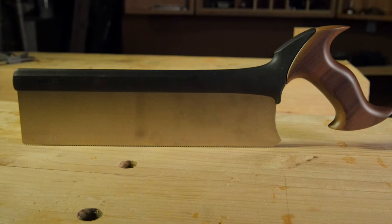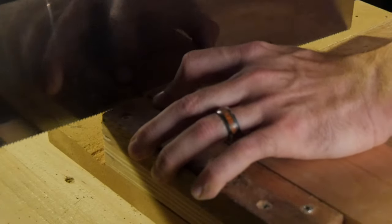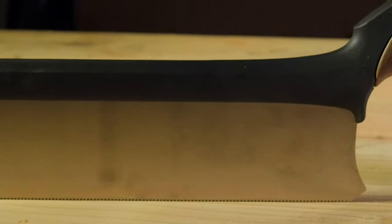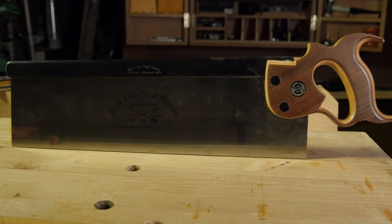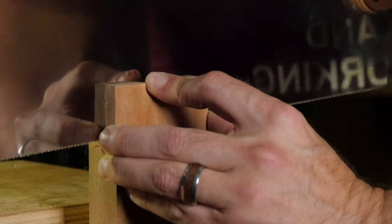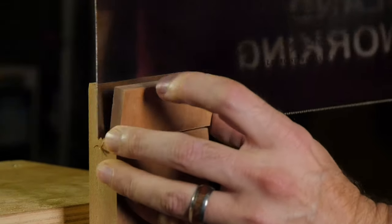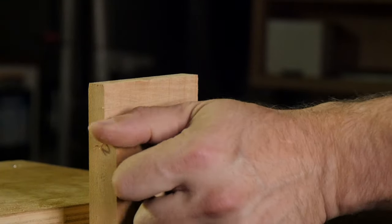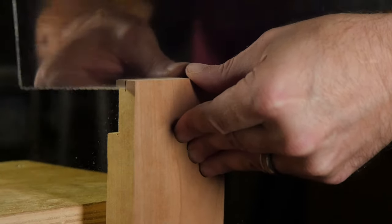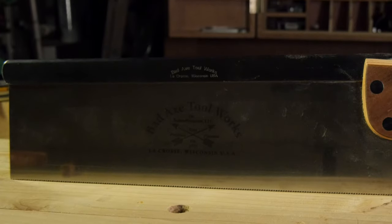The carcass saw is 10 to 14 inches in length with around 12 points per inch and a minimally thicker plate than a dovetail saw. The carcass saw gets its name from its overall usefulness for all-around work on the carcass or skeleton of a piece of furniture. This is a great overall saw that can be used for multiple functions. Next up in size is the tenon saw. The tenon saw gets its name from the tenon — they excel at cutting the rips for the cheeks of tenons and as such have a deeper and thicker plate with around 10 points per inch. Tenons can be of varying lengths, with some being quite deep. The depth of plate under the back limits the depth of cut, so the tenon saw offers the greatest depth for its intended purpose.